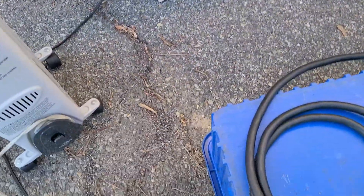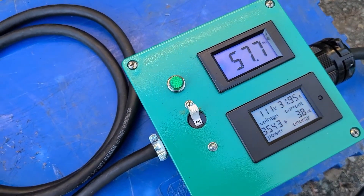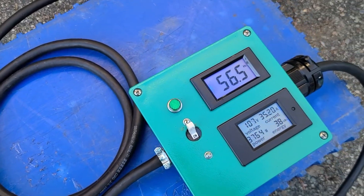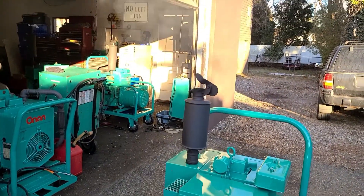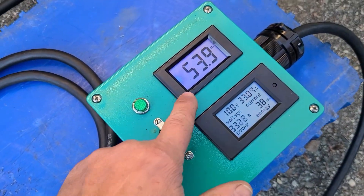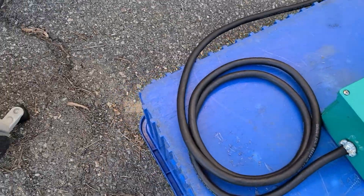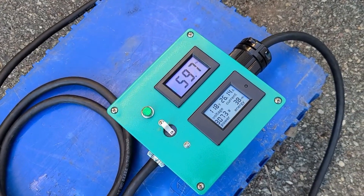Let's go up higher. The hertz is dropping, as you can see, and voltage is dropping as well — that's not the best. We're not getting more than 3,500 watts. Let's go full blast. It's dying — look at that smoke right there. We are not good. We really want it to be around 59 to 62 hertz. Voltage is no good. Let's back her down. All right — we're back in the acceptable range now.